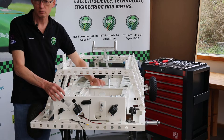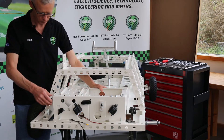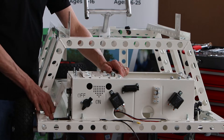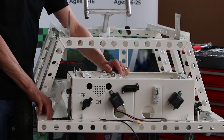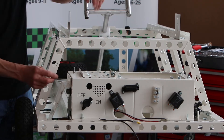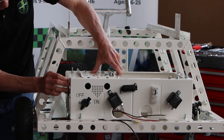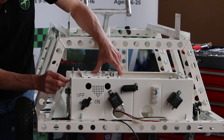So now we're about to fix our motor cage onto our car. We assembled this earlier of course, and to facilitate that, what I've done first of all when we fitted this cover plate here when we're doing the back axle, I tightened up these two back axle mounting bolts. So now I've slackened those off so you can see this moves quite easily, and I'm going to take first of all the fixings for here, so looking down through the hole, moving things around until they're aligned means I can hopefully get that screw to start threading into there.